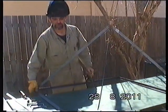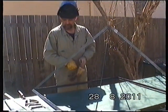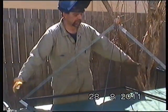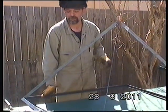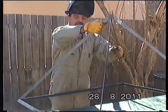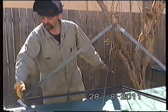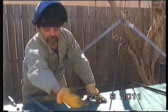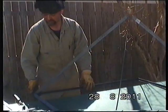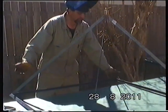So once you've done this much already, you place the parts here - you've already reinforced the base and structure. It's a solid base structure, not that heavy, easy to handle. You're just going to weld the corners, just stitch around, weld the corners all around.